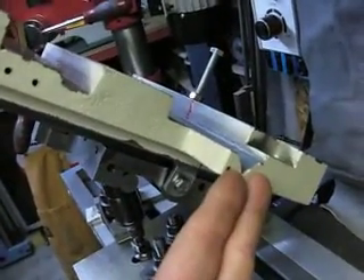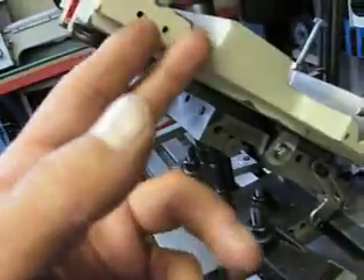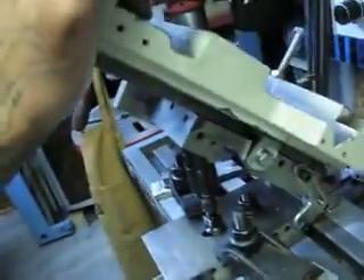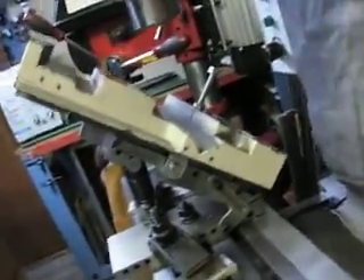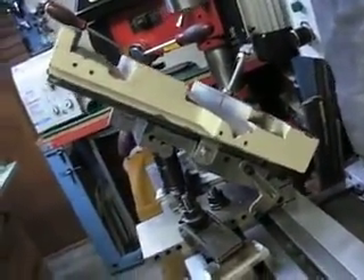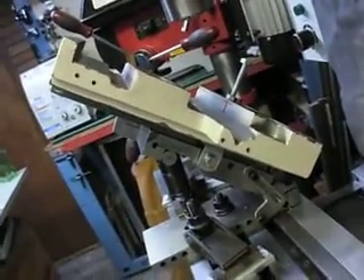I ordered some Teflon. I'm planning on making a mechanical attachment on each side using these screws, and then some heavy duty wipers to keep the crap off the Teflon. My carriage will ride on Teflon, and as long as I keep my lathe clean, my Chinese lathe should last essentially forever, because I can just replace the Teflon pads when they get worn down. I think I got enough Teflon to do this probably five times over for about fifteen bucks.